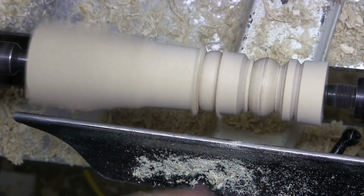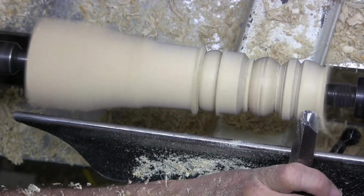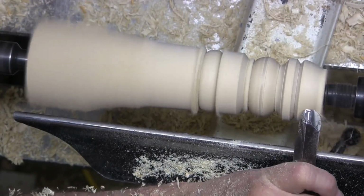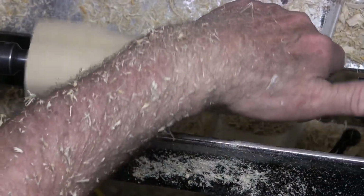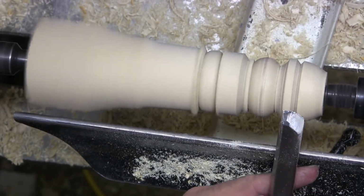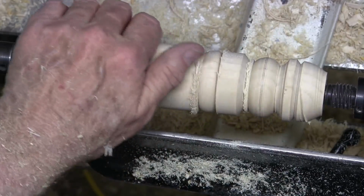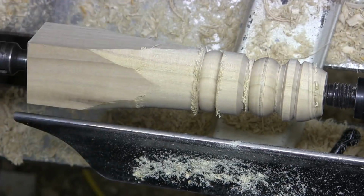But it gives you more control, because here's the problem with the rolling cut if you try to do it. This is not using the point in the wood. Beautiful finish, though. Look at the shavings that are coming off. When you see those kind of screw noodles, you know it's a good cut. And it just polishes off the end grain beautifully. But here's the problem. It's very easy to get this. That. Mark of Zorro, we call that. Like that. Does that look familiar? Surface texture. Everybody. Come to this cut last of all.